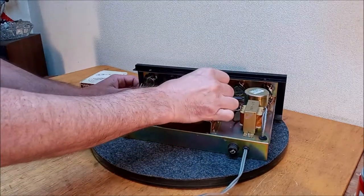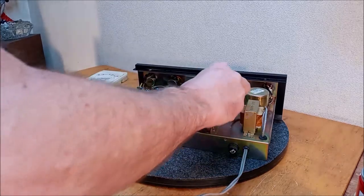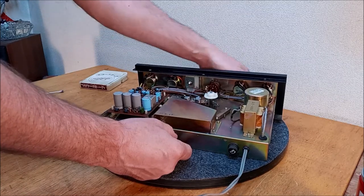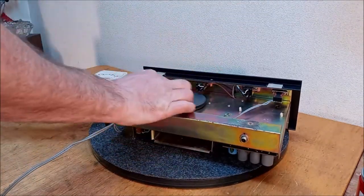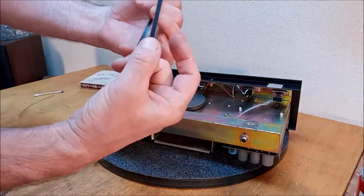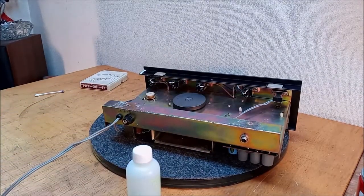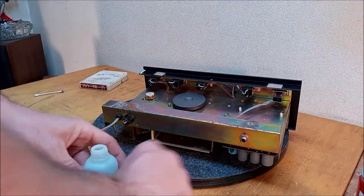That's for sure. All right, we got a little bit of gunk around the bearing here. So I'll get a little oil for that. Well, we're really looking pretty good. Man, even the belt's in good shape. We'll turn that inside out, and I'm going to give it a quick wash here. I just use pinch wheel cleaner. It's just a rubber cleaner that seems to work pretty well. Just kind of takes whatever buildup is on them. Gets rid of that slipperiness that kind of develops over time.